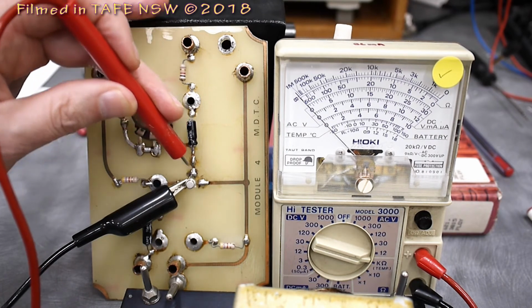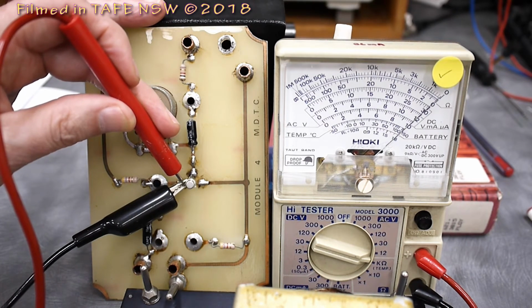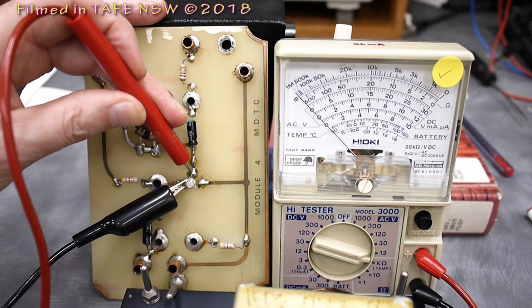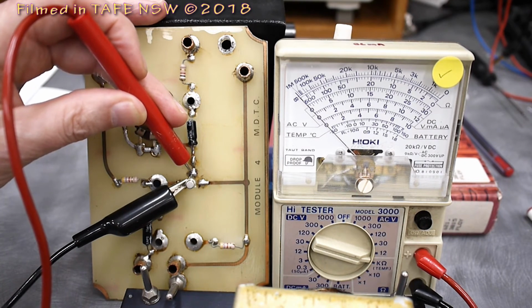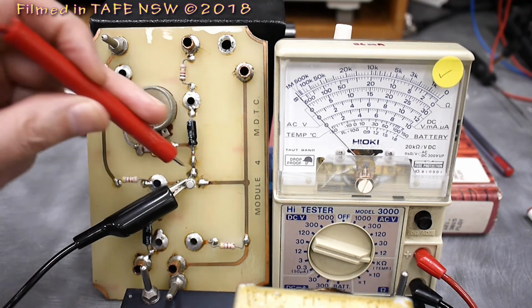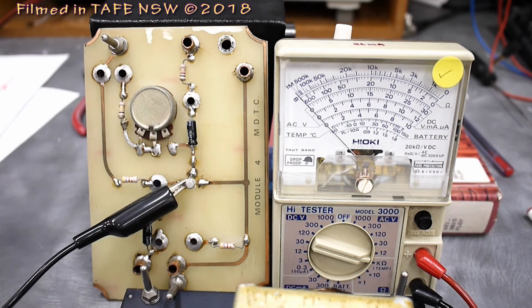If the junction was short-circuited, for example, the leads go together, we get full-scale deflection. That's reverse biased, we don't get any deflection, no current flows. We had it forward biased before because we put the positive lead, current speaking, onto the base.